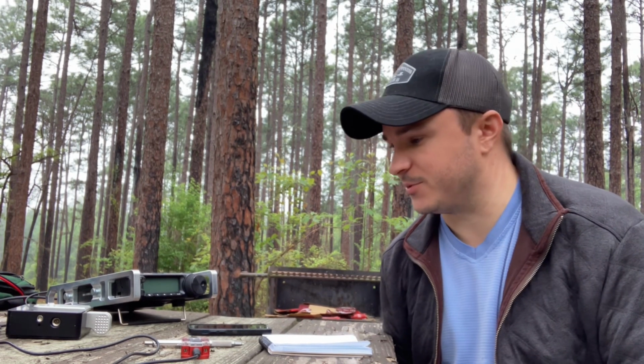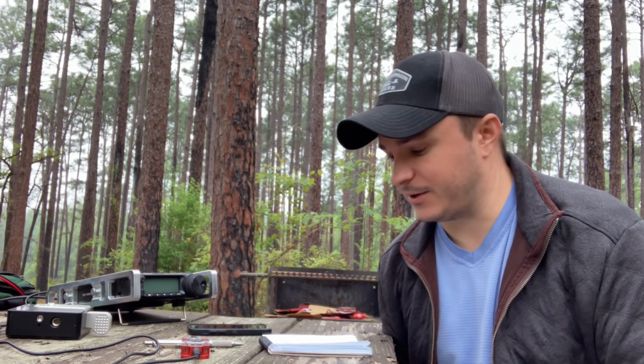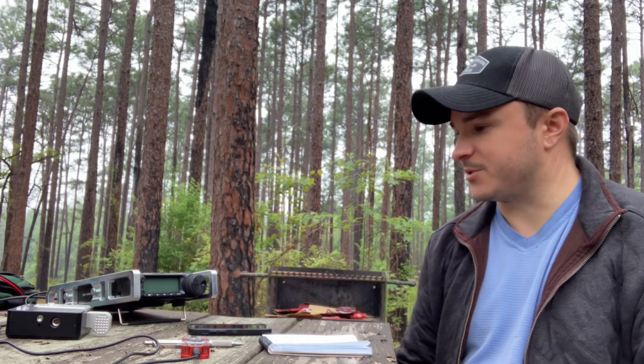I don't think that QRP was the issue. I think that when I went on 40 meters to begin with, it was just after 6 a.m. and there just weren't that many people hunting. And then I rolled up to 20, and I think 20 and 17 both were pretty much just band conditions were dead. They weren't open yet.